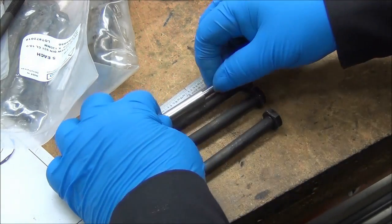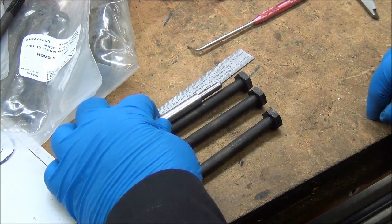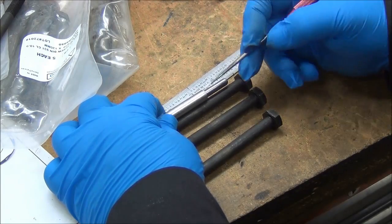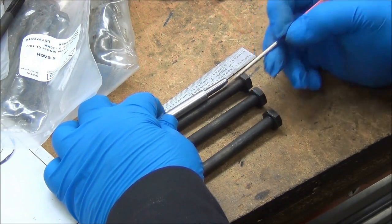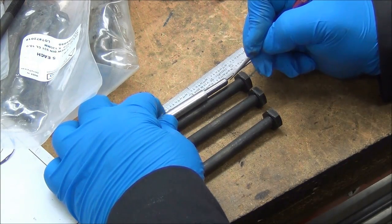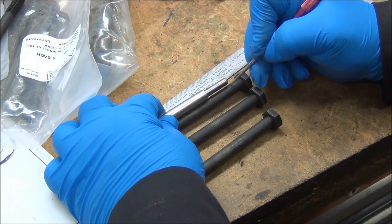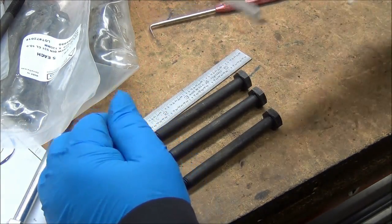Basically what I need to do is eyeball it — if three inches is going to be the shoulder, I've got to figure out how much meat I want to leave sticking out at the end. I certainly don't want to have to try to cut right up to the jaws of the chuck, so I'll figure that out and see where this one sits.